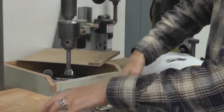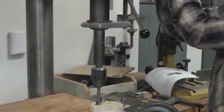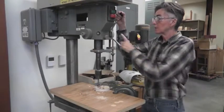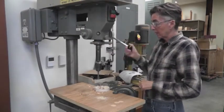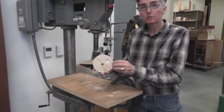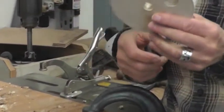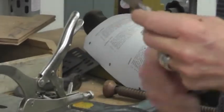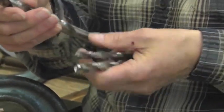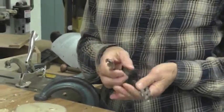I'm going to put this back in the clamp — now we're ready to drill. Because I set this stop here, it can't go all the way through; it has to stop at the very bottom. You can see the kind of hole made by the Forstner bit: it's got straight parallel sides and a nice flat bottom with just a tiny little hole in there. And then we have the nice smooth hole made by a brad point or a twist drill. If you see a burned bit there, that probably means somebody used it improperly and it may not be as sharp as it should be anymore.